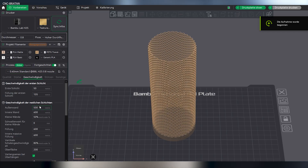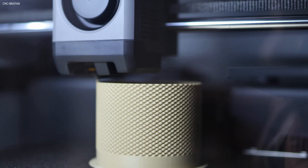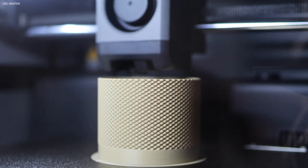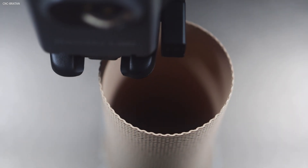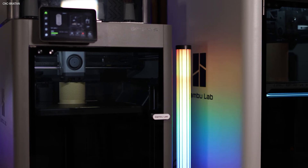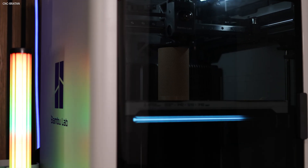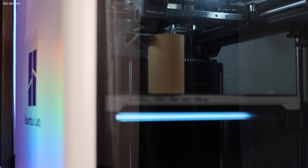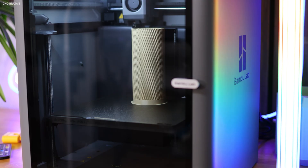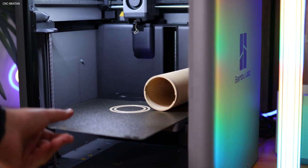That's exactly why we can't print very fast with such big nozzles. Even though the high-flow nozzle in the Bambu Lab presets shows 500mm per second, it's still recommended to print slower because PLA needs good cooling, especially on overhangs. You can also increase your nozzle temperature a bit. The 0.4 nozzle needs two layers to reach a height of 0.4mm, with each layer printed twice for standard two walls. You reach the same volume with the 0.8 nozzle in just one layer and one wall. As an example, slicing both nozzles with default settings at the same speed of 200mm per second makes the difference obvious.